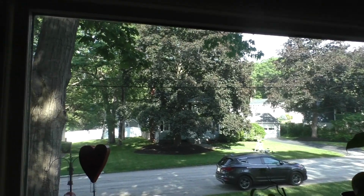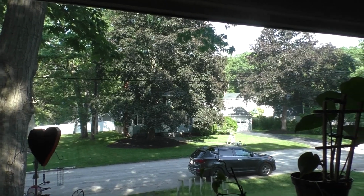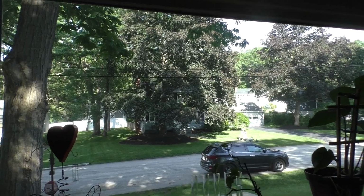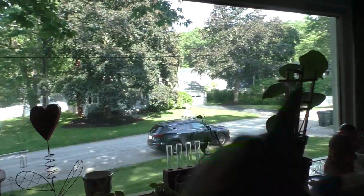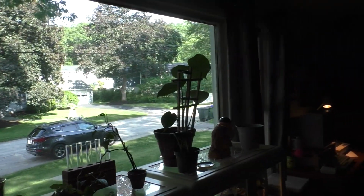Now, IGUs, I think they were invented in the 1930s, but they really didn't become commonplace in residential buildings for quite some time after that. Again, this house was built in '54, and this is actually a nice warm window, believe it or not. They made the picture window an IGU, but the side lights are single pane. So whatever, it works. I'm not replacing it. It's not rotted. It's in actually pretty good condition. So this window is not getting replaced anytime soon.